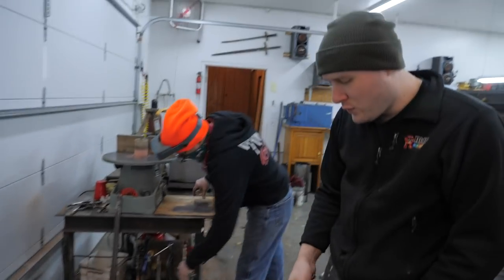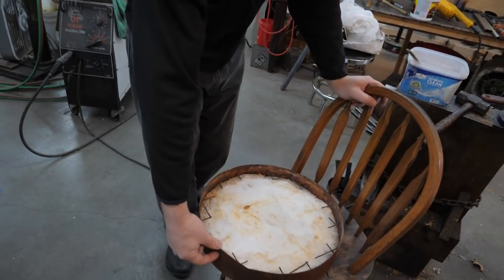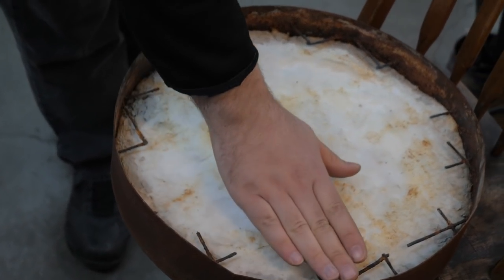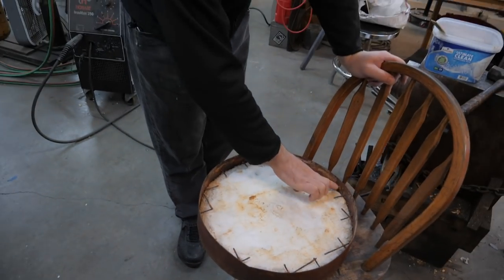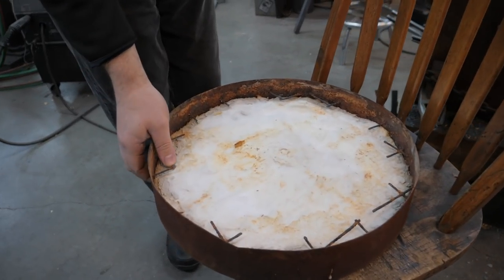Mixing up some Satanite. I've got to cut out some insul for the lid that we just bought. I should cut the lid out before I mix up the Satanite, because I might put a little bit of Satanite on the kaowool to help protect it. That is a lot of kaowool. I think I'm going to grind this down a little bit so the kaowool can be flush. It's a one-inch layer and will only fill it up to about there, so if we grind about a half inch off, the kaowool should sit all the way up against the forge.